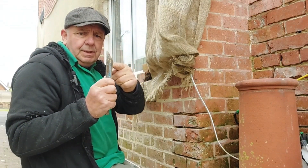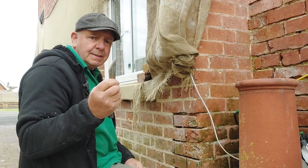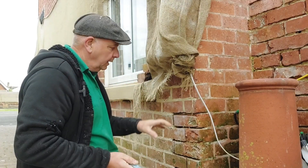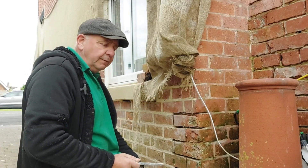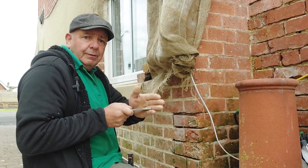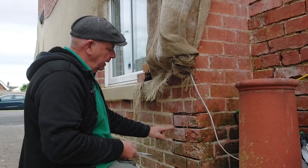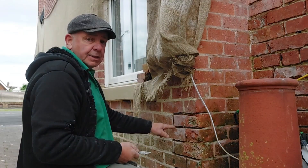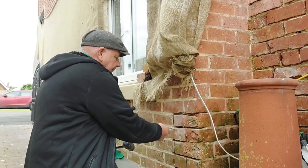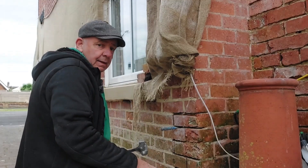If you look at the edge of your chisel, it's on an angle — not because it looks nice, but for a reason. You learn how to turn and move the chisel around with each particular job. Because it's a wedge, it'll dig in one way, so you turn it around and it'll dig in the other way. For example, going up against the perp, I use the long flat edge against the perp and it'll push away the mortar that way. See how nice and easy that went in there.